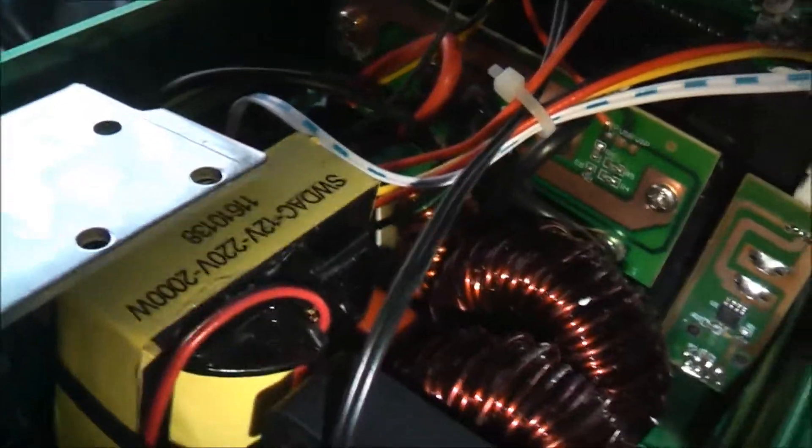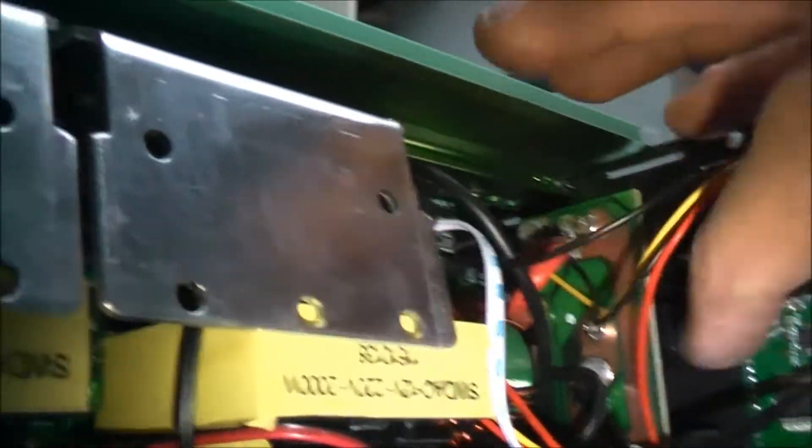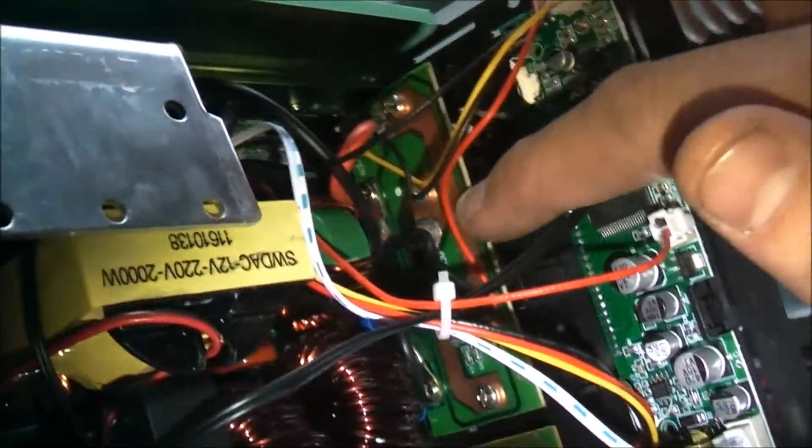This looks like it could be a weak point, but it's quite a lot of copper on that, and it's quite a wide trace between the active and neutrals. So it would do it. It's quite a wide trace — it would do 10 amps, 11 amps, at 240 volts. I have seen appliances with traces like that. The Mishto's got big traces like that for a 1500 watt inverter. I'll definitely put some solder all over that — build all these traces up with a lot of solder to thicken it up. That could get a little hotter if I'm pulling 10 amps all day through this thing.